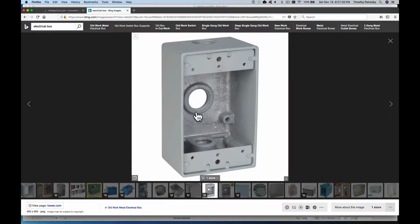Then out the bottom, there's another hole. This hole at the top's plugged. There's a hole at the bottom. Actually, mine has 2 holes in the bottom. And what I do is I take those wires and I run them up underneath, and I run them into here, and then I stuff foam in here so it's sealed so no air gets in.